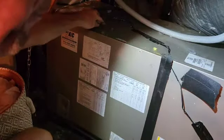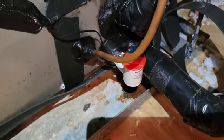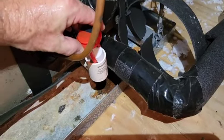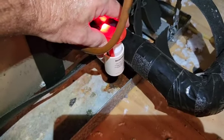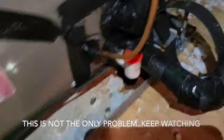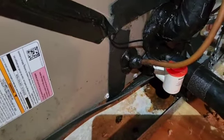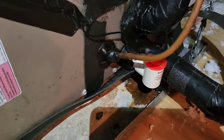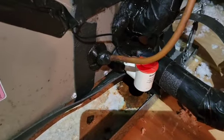Now I'm going to go ahead and power up the air conditioner. And hopefully — as we do see — there is no light on this sensor, this float switch. If I take it out and push the plunger down, now we have a light. In fact, it doesn't come on for quite a long time — there has to be a lot of water for that to trigger. So I think this was our problem. You could have another problem causing your thermostat not to come on; in my case, I've been monitoring this for several days. I highly recommend this float switch with a light so you know that it's been tripped — because otherwise, if there's no light, you don't know if the float switch has been tripped or not.